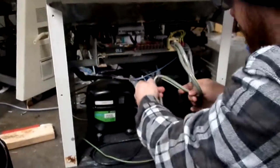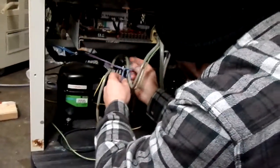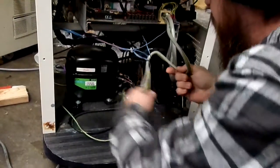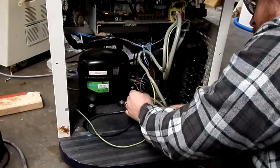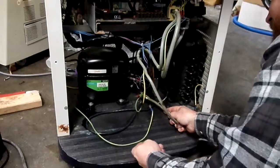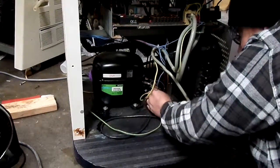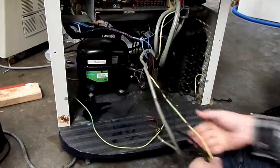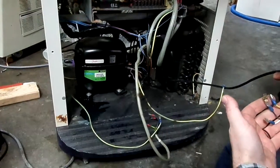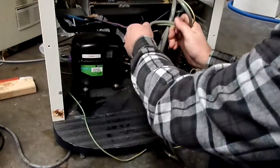What the heck did they do? They just taped it off to the ground wire. They didn't ground the compressor. I'm pulling off all the wiring on the compressor and the compressor fan motor — they grounded the fan motor but not the compressor. Morons.